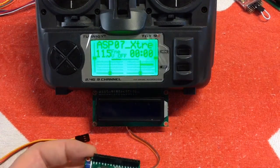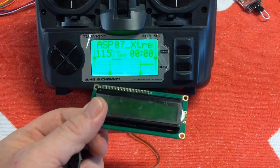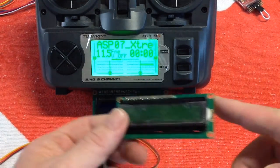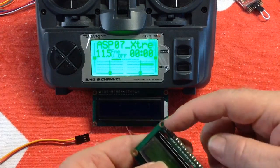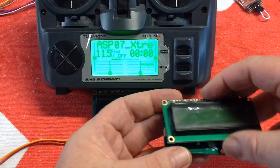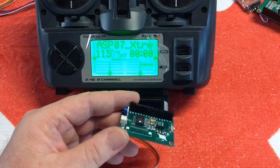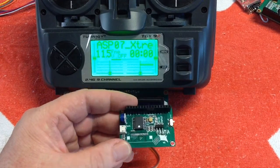You pick one of these up and then go online to eBay and buy yourself an LCD screen. These are available on eBay for about $3 with postage — that's cheaper than I can even post one to you. You just need to buy one off eBay for $3, solder on a 16-pin header — it's a pretty easy solder job — attach it onto your LCD backpack, and that should all come in at less than $15. I'm making these LCD backpacks more available because a lot of the new boards I'm bringing out all interface with the LCD screen so you can see what's going on.